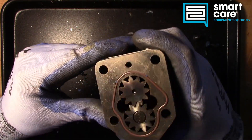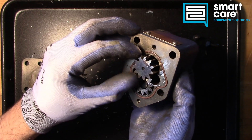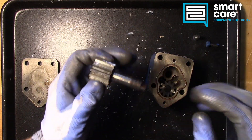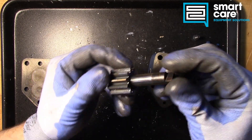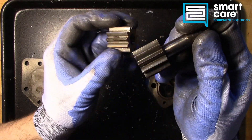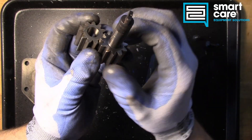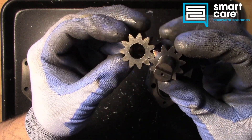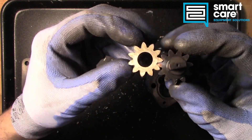This particular pump does not look very bad. There's no signs of rust in here, and we can get rust if someone has run water through the filtration system, which is a really bad idea — you never want to do that, but occasionally it does happen. And if that happens, you'll start to see rust in here, and when the pump runs it will just grind itself up. Now these meshing rotors — be very careful if you ever pull one of these apart, because these edges can be very sharp. Typically the failure we see is either the seal, like what we're seeing on this one where the sealing surface just doesn't hold anymore, or we get debris that jams these rotors. They mesh together very finely, and if any debris like crumbs, breading, or pieces of food product get pulled in past the filter paper, these will jam.